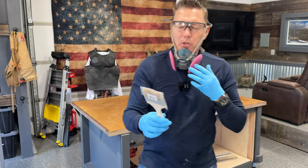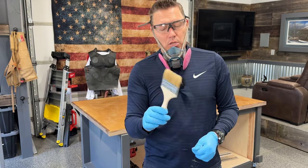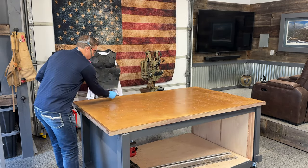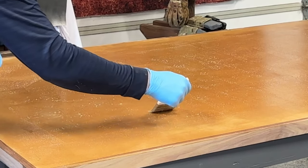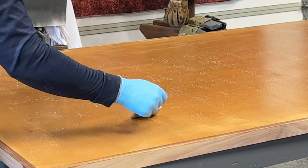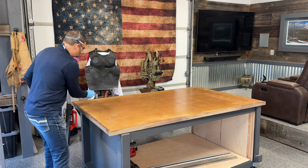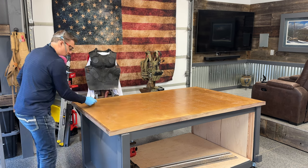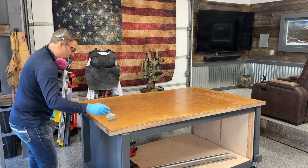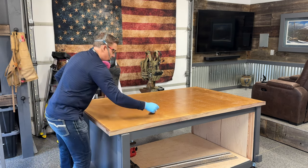One thing you'll see is people using a three-inch chip brush — designed to be throwaway but can be cleaned and reused. They use it to knock down the air bubbles. I'm going to take it down one swipe so you can see how it knocks down the bubbles, because as we roll back and forth we're agitating the chemical and introducing oxygen. So I'm going to do a final light back roll — a final brush roll — and you can see the difference between where I started and where I ended.